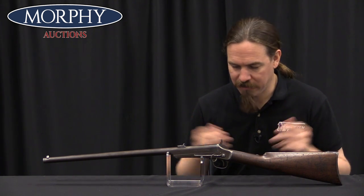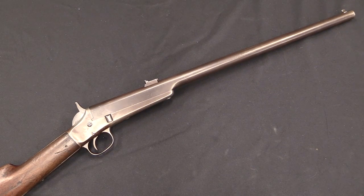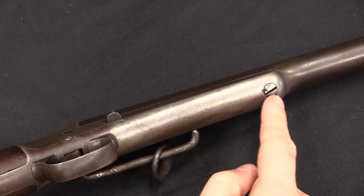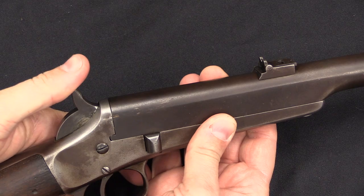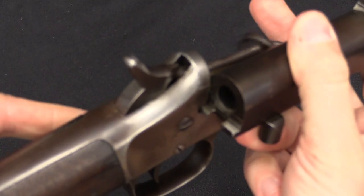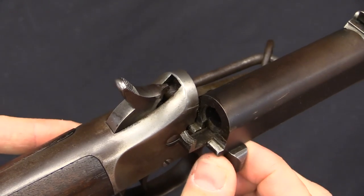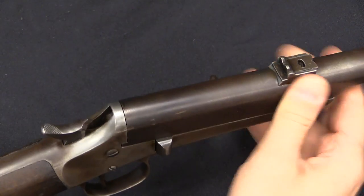So many of these Civil War breech-loading carbines are tremendously simple guns — it really shows you don't have to do much to make a single-shot breech-loader, and the Lee is certainly no exception. The principle of this one is that the barrel pivots on that screw. In order to open it, you pull the hammer back to the safety notch, then put it to that position, and swing the barrel open. This button is a completely manual extractor — pop out the empty case, put in a new case, push the barrel back over.